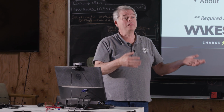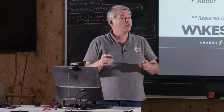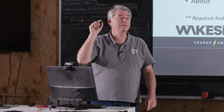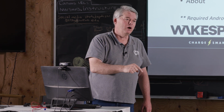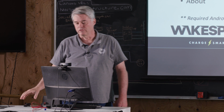You may get a really gnarly situation where somebody sends you a trial version of firmware, or where you, for some reason, choose to do a down rev version of firmware. And you've contacted our support and they've sent you a DFU file. That's the file that has the firmware. Going into expert mode is what lets you select that DFU file and send it into the regulator. Otherwise, you're only going to get the latest version.